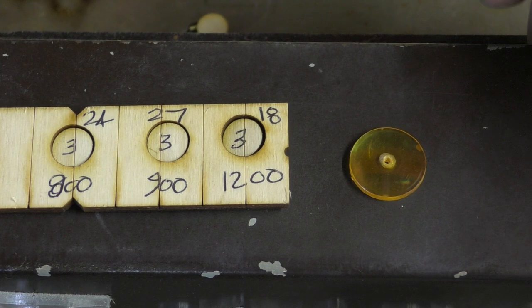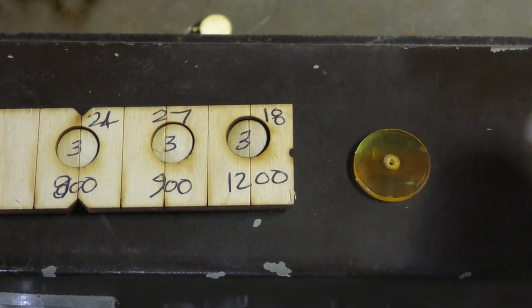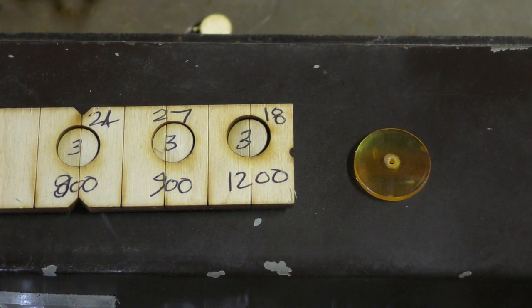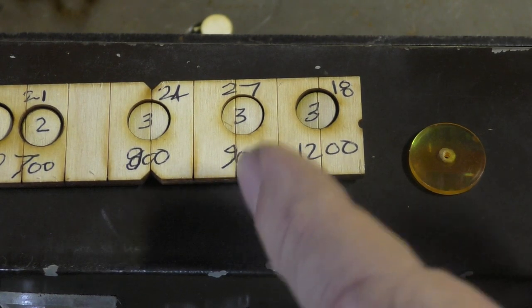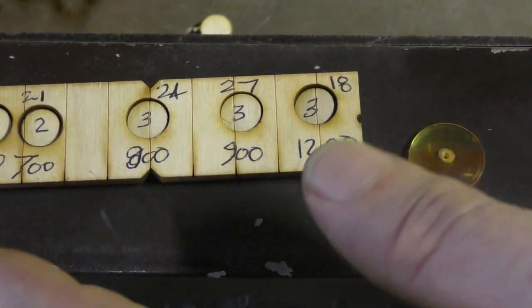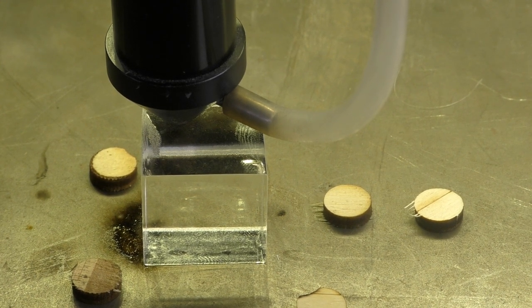This is twice as fast as I can cut with the 40-watt glass tube machine, so I'm already doing something significantly different. It's quite interesting - 21 to 27mm/sec - there are slight differences in the way power is being used by the lens to create cutting. Although I understand how cutting takes place, I still don't understand how the power has to be distributed within the beam for most efficient cutting. I remember a year ago when I first started trying to find out how lenses cut, I did something to a lens that completely destroyed the cutting function - it engraved extremely well but would not cut.